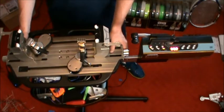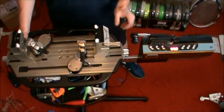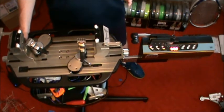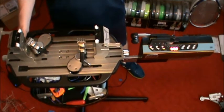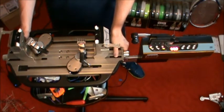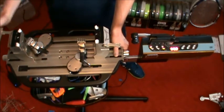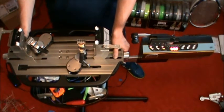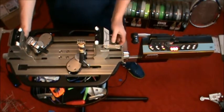Drop weight machines are a constant pull machine, and electronic constant pull machines pull and adjust. A drop weight, obviously gravity never changes, so as long as gravity is pulling down on the drop weight bar, as the string relaxes or loses tension, the bar will continue to fall a little bit, which doesn't mean you're losing tension, it just means it's compensating as the string is stretching.